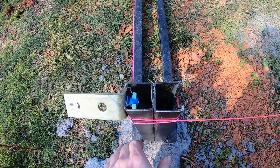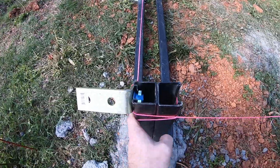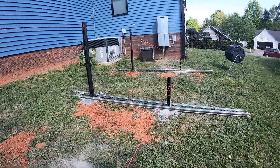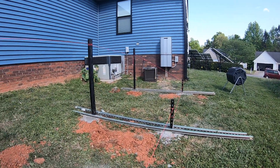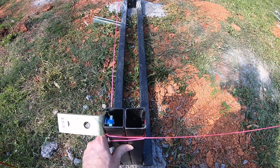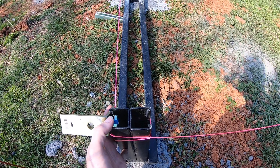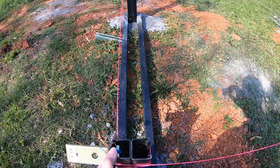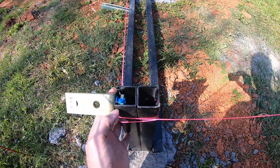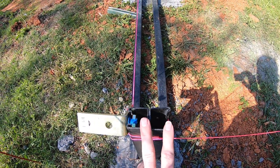The way we started this was we determined where we wanted our first corner here and then we built everything referenced off of this corner. You can see our back pillar there, our other two fronts, and then our other two back pieces. The angle for this area — for solar panels, per a few websites — does vary by the month, but generally about a 30 to 35 degree angle from where I'm at does a pretty good job of covering most of the year.